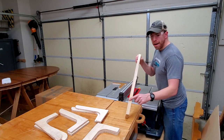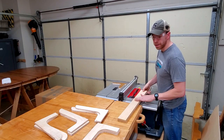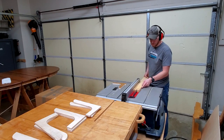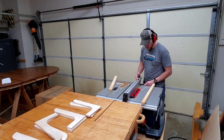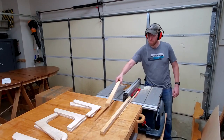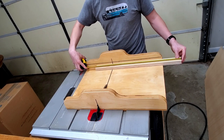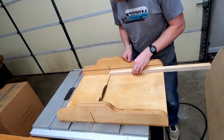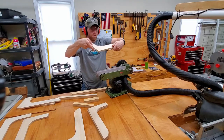This is two pieces of half-inch glued together — I'm going to cut some of my center divider pieces out of this. It's wide enough as a center divider for some wide bar clamps, and the others I'm going to cut to one and one-eighth inches for some three-quarter inch and one-inch pipe clamps and for F-style clamps. Here I am cross-cutting each center divider to the length I need in order to raise it to the height for my bar clamps to clear above the material storage cart.